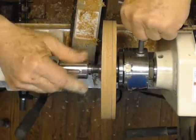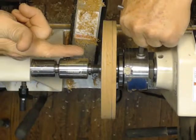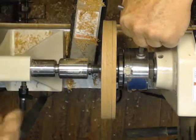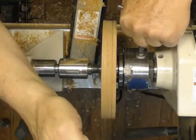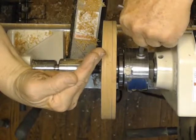This, because I can grip it. The mortise I have to expand, I can cut that tenon with the tool a lot easier than I can come back and cut the dovetail. Because as this one's coming in here like this, I have to come back in here. I can't get to it from here.